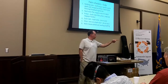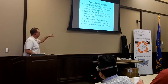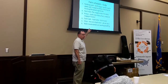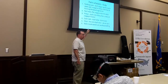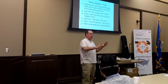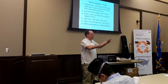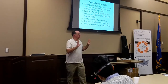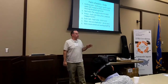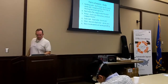I've experimented a little with polyester resin for surfboards, but it stinks terrible so I won't use it anymore. I'm eager to try the two-part spray can material. Wait two weeks before you try to wet sand and buff. I have finished a guitar and wet sanded it 24 hours after spraying multiple coats of Bona, but I wouldn't necessarily recommend that. When spraying Bona, use thin light passes — spray it so it looks beaded up like in a Thompson's WaterSeal commercial. Let it sit 20 minutes and those little droplets will flatten out and flow together. You need somewhere around 15 to 20 coats of clear finish to build up enough thickness to withstand wet sanding and buffing.